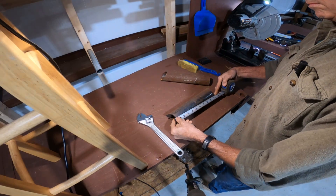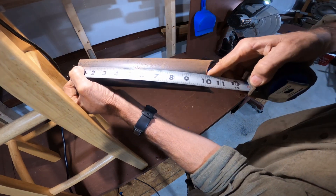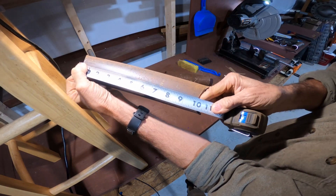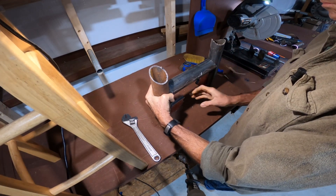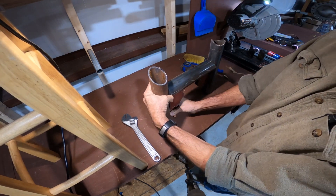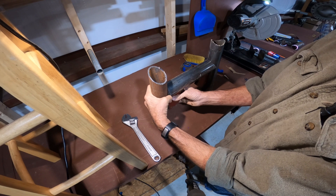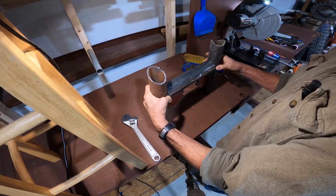Now it's the moment of truth. I tried to get a 10-inch pipe out of it, and we did — we got 10 inches between the saddles. I ended up adding three-quarters of an inch to both ends and then made the cuts off of those two points. The other test is lining it up between two vertical pipes, and the pipes stay vertical, so those saddles are aligned using that seam to keep everything lined up. It worked out pretty good.